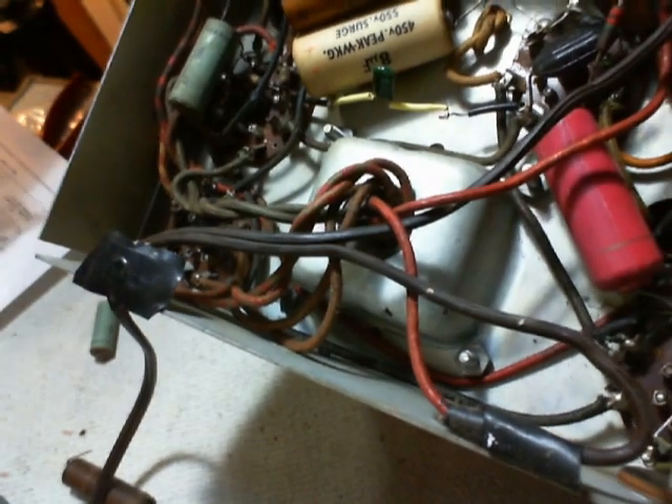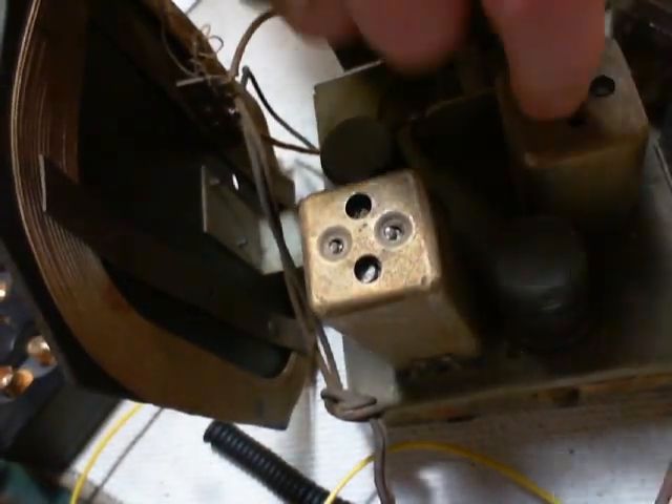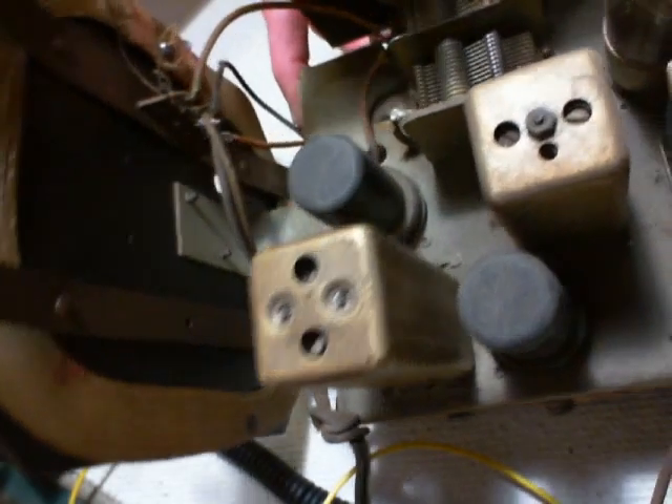You know what? This IF is open at the bottom — this one here. What's up there? Let's take a look. Now I see a screw right up at the very top of that. Oh, you know what that is — that's just the screw holding this. So it's just these four adjustments on the IF, yet I'm seeing something on — oh my gosh. It's the trimmer capacitor right on the tuning capacitor. It's really awkward to get at it.